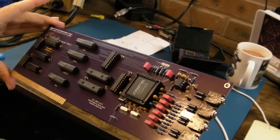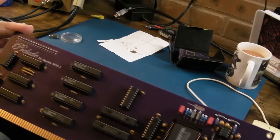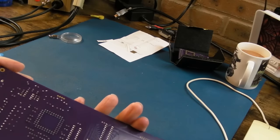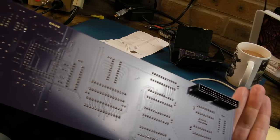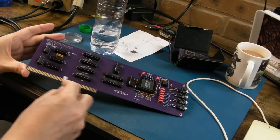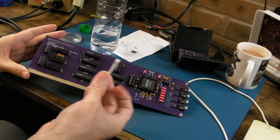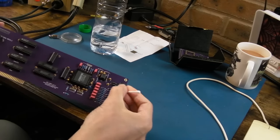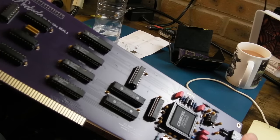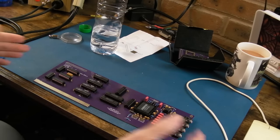That was painful to clean, it really was. If you have a look at the top of it now it's pristine - there's a little bit of flux in there actually, wipe that off with IPA. I forgot to clean the solder points there but the ultrasonic dealt with that. On the underside as you can see it looks pretty darn good. Be careful not to go too overboard wiping gold contacts like this because you do still get some coating off with just a rub. That's looking absolutely immaculate - there's a scratch there but it had that when it came, so that's a manufacturer thing.